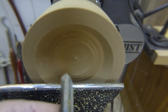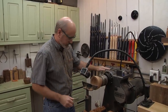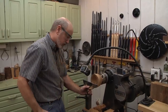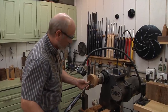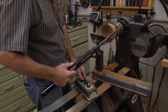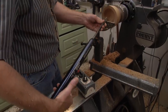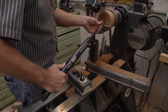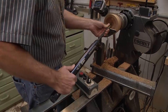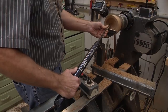So that's about the thickness I want for my walls. I'm going to lay it off just a quick second. I want to lower my tool rest a bit, just come down to here. I want the angle to be just about like so — almost like it's against my hip when I'm doing this. I get my best cut that way. Unless you're John Jordan and he likes to straddle the lathe, and it helps when you're 6'6 or something like that.